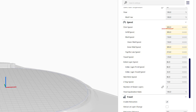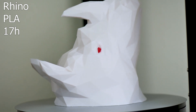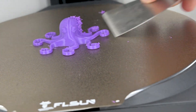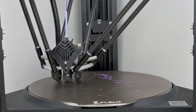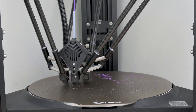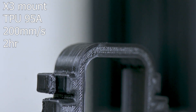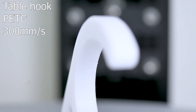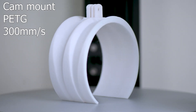Staying at around 300 millimeters per second produced satisfactory quality results with decent speeds, and I'm super happy about how fast this printer works. On super-soft TPU I couldn't get more than 30 millimeters per second, so that's not really relevant. But on a hard 95A TPU I could print at 200 millimeters per second with a satisfactory result. PETG also printed quite well at 300 millimeters per second using just the general slicer profiles.